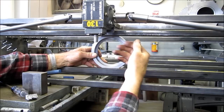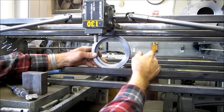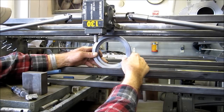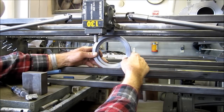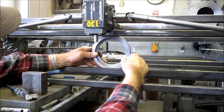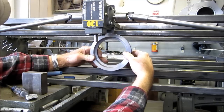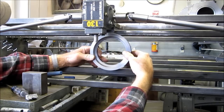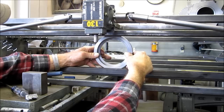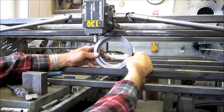We're looking at the depth we want. We want these rings to be centered in our two crossbars to be ideal for our travel. We're going to take these in and mill 5/16ths off the outside, straight across from each other, so the ring will set right inside there. Let's run it into the Kearney and Trecker and whittle some material off those two sides.